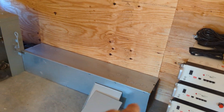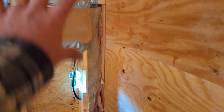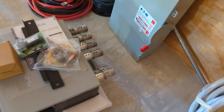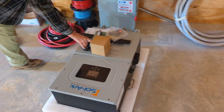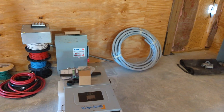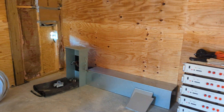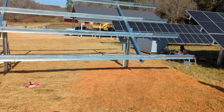We'll have our 15k, our bypass, and then back and forth wiring to get this all hooked up. Wes has got the inverter ready to land. We could get this thing built tomorrow, and then Monday will be a commissioning day — and then on to the next. First job of the new year, and it's nice to have a simple, straightforward job to kick it off.